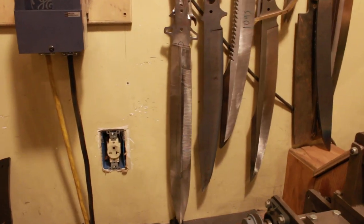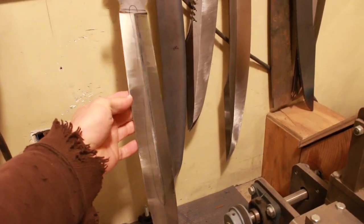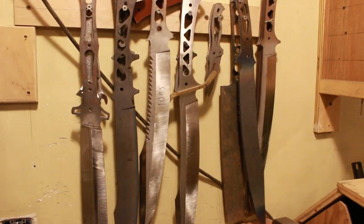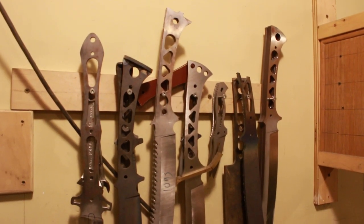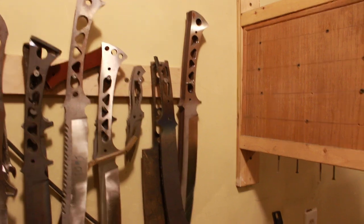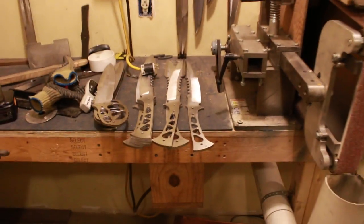Here on the wall you can see the Murder 2 — I've already ground the whole thing, and you can see how it's a straight sort of compound twisting bevel. This will need to be hand sanded probably. Before heat treat, I've got what I guess are two final Kodiak sawbacks with their welded-on pommel and hilt. And then I've got four 5160 Kodiak swords in standard format which will get heat treated and mar tempered. One of those is spoken for; three are going to be available.